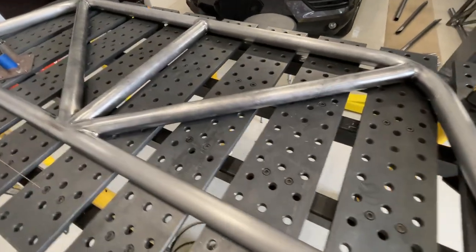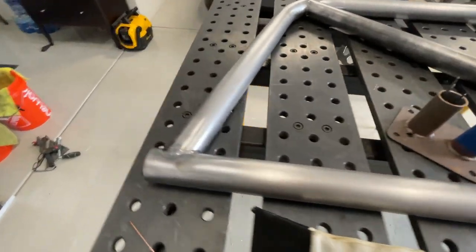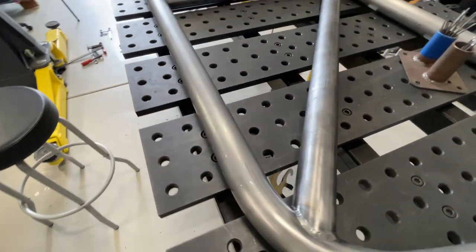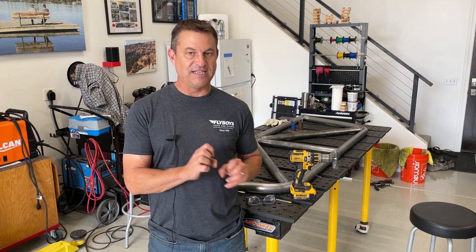Here's the finished project. I'm pretty happy with the fusion that's going on with the welds - I could probably work a little more on the aesthetics, but they're coming along not so bad. I'd be happy driving in a truck with those over my head. About 30 welds down, only about 200 more to go. People always ask what's the best tube notcher to get - I always say forget the tube notchers, get two angle grinders and the Bentec software. These copes were pretty easy, but on Honcho there were places where nine tubes all joined to one center point - you can't do that with a tube notcher, but you can with Bentec. Coming up: rear suspension, engine cradle, engine mounting, and the front chassis. Please ring the bell, leave a like and a comment - we'll see you next week.